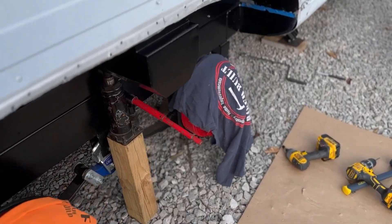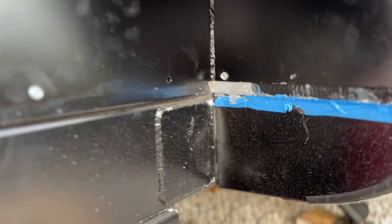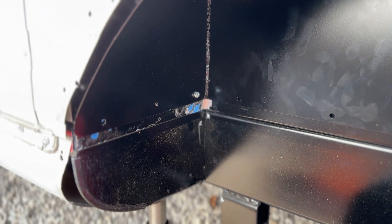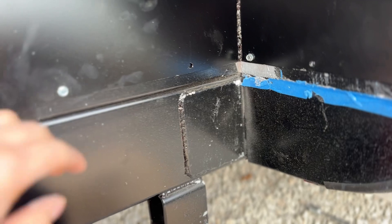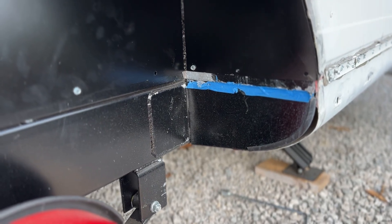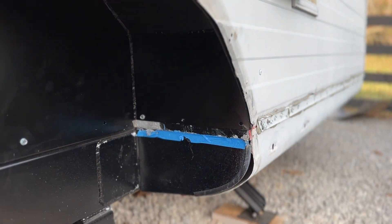Little update here - that was a heck of a fight and I didn't think it was going to work for a minute there. You can see it really tore up the paint. It was probably about a sixteenth too long, but thanks to our friend the bottle jack here, we were able to persuade this thing up in there. There are still a lot of screws I haven't put in yet and it's pretty flexed out in spots because of the way it was forced. You can see back there I had to grind the welds out of the corners. The other thing I didn't account for in fitting it was that this plate stuck out - I thought I was going to be able to install these from the top, but I had to go from the bottom, which really complicated things. Thankfully there was enough flex on this aluminum to get it up in there and then push it back.